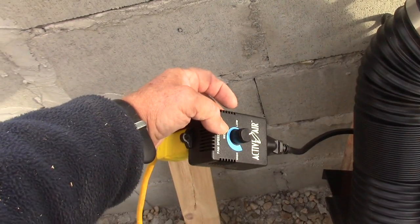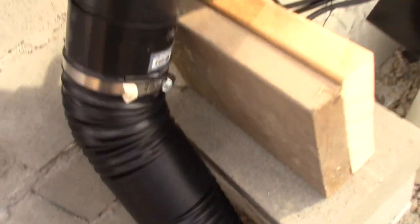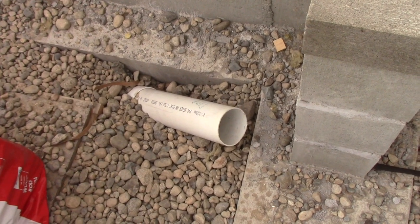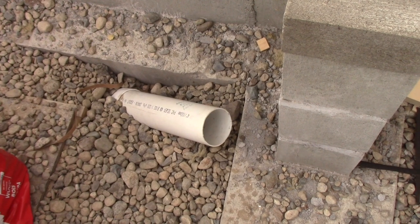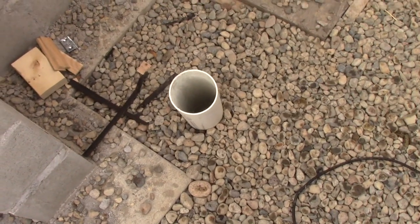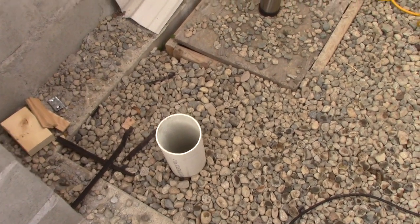This plug will go right into a plug on the wall once I get my electricity installed. It's just running off an extension cord from the house at the moment. Now the intakes for these — there's the intake for the 6 inch. It's low down right around the floor where the air is going to be coldest. I will put some screening over it to keep any mice, spiders, beetles out of there. I may even turn it so it comes upright so things don't get kicked into it. There is the pipe for the 8 foot bed — same thing, it needs a screen. But those are my intakes.